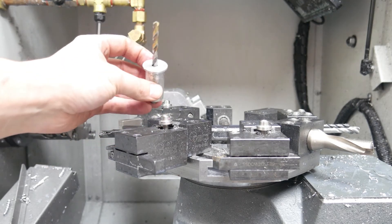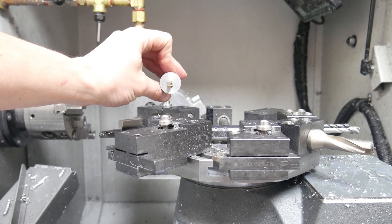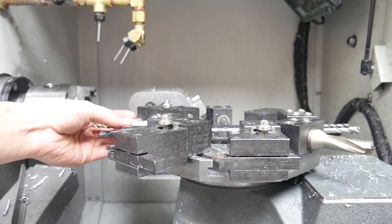This holder, for instance, was made just for a 5.4mm drill. You can see the drill is not on center at all. There wasn't anything I could do about it — we used the chuck, put a drill bit in, and drilled the center, but because the height was off you can't physically get it exactly to the middle of the holder. I hadn't really twigged at the time that there was a major issue; I just thought the drill bit wandered a little when it was being drilled in. But obviously it was the machine problem. Great to get it working again, but a nightmare of a journey.